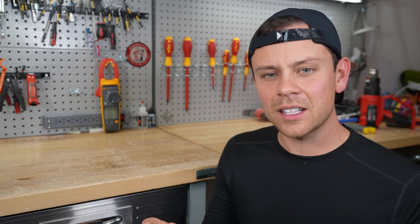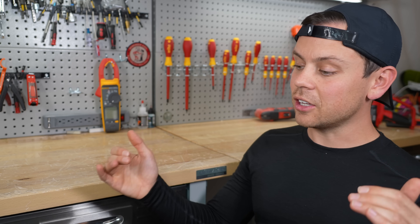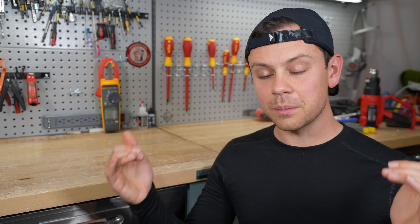In past videos I've covered this many times — I've shown the graphs, exact sentences from studies, and the results of tests — and people still question it. What I am telling you is exactly what the literature recommends. People are messing up by not keeping their batteries charged enough to balance them, because if one cell is being more abused than the others you're going to have a problem sooner. The cells need to be cycled together and stay at the same state of charge to remain healthy.